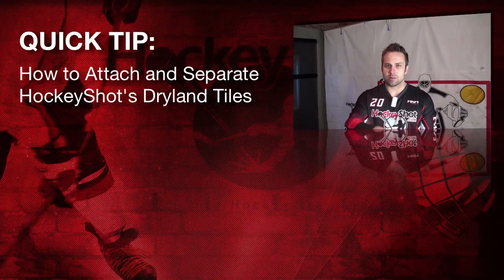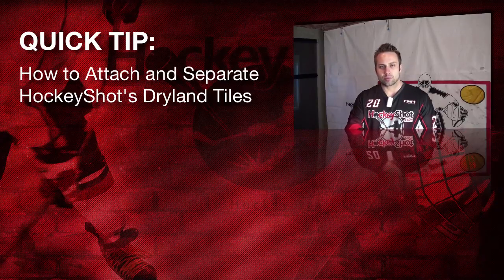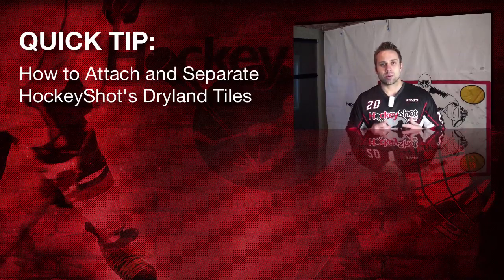The only real room for error is if you accidentally anchor down the wrong side. If you anchor down the tab side and then you're trying to yank up on the loop side, it won't work, and you run the risk of cracking a tile or breaking off one of the tabs or one of the loops. So just make sure you're anchoring down the right side, and then once you get a string of them started, just keep pulling and slide your foot down to keep that anchor as close to the area that you're pulling on as possible.